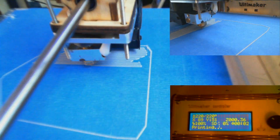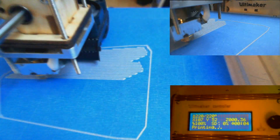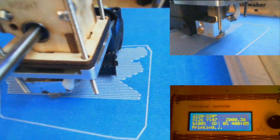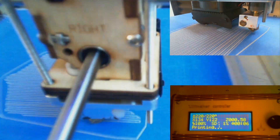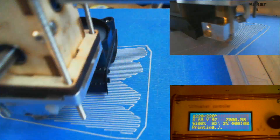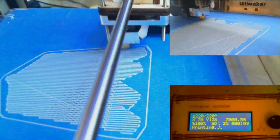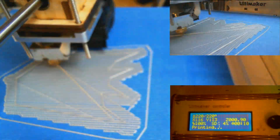Right now I'm printing it, but I'm doing something a little different than the Autobot logo. I noticed the Autobot logo had some deformation on the bottom because as it cooled it tends to bend away from the platform. So on this print I'm using something called a raft — that's what you see the printer printing right now. It's laying down a first thin layer, literally building a larger surface stuck to the board that it's then going to print on top of, and you basically tear it away when you're done.